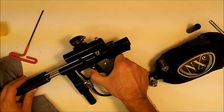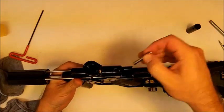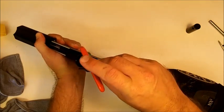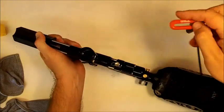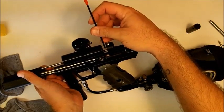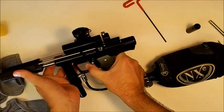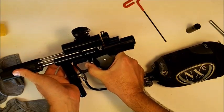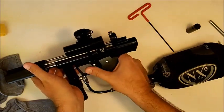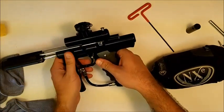And it fired late. Not crazy late, it still did fire, but it fired late at about 1/32 or something. Okay, so what I need to do, because it's firing late, is raise the lug up so that it fires a little earlier. If it's firing at this point, drop the lug down. You know, righty-tighty, turn it down, okay? If it's firing late, raise it up. Let's see how that little bit of adjustment did. That's about perfect, man. Yep, I'm gonna drop that just a little bit because I'm anal. Little dab will do you there. So now I know that this thing is set up properly in auto trigger.